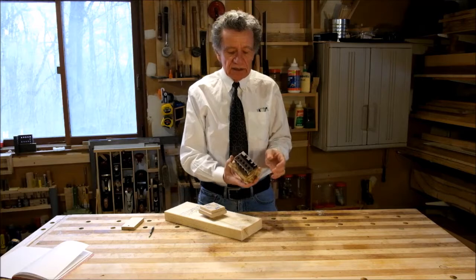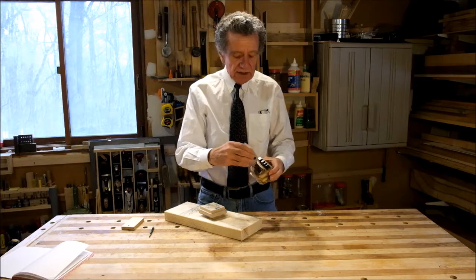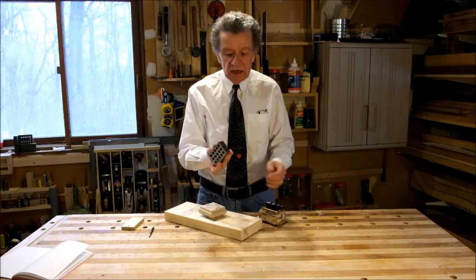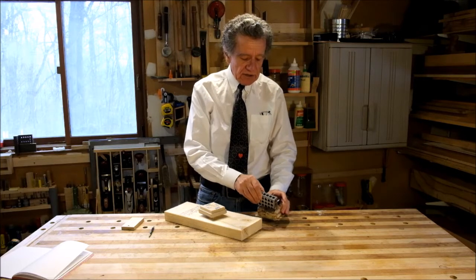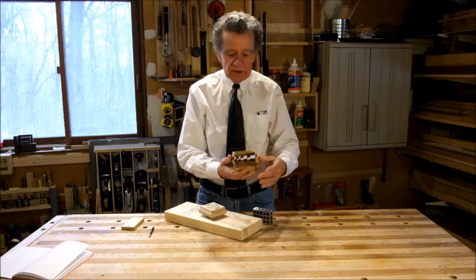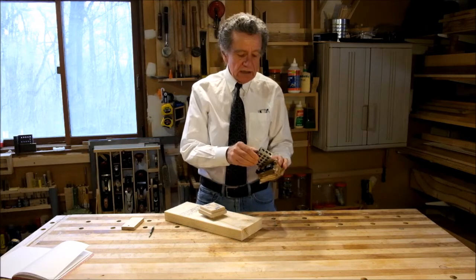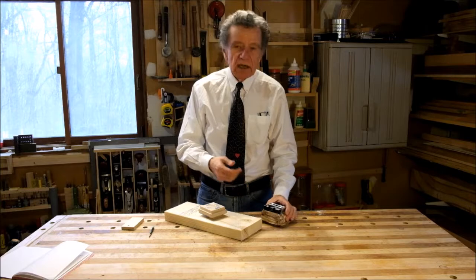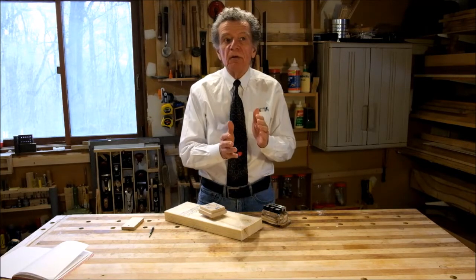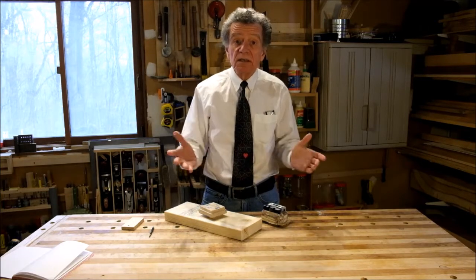The tool I'm glad I bought is a set of setup blocks. These are metallic blocks — a machinist will recognize this as a one-two-three block because of its dimensions: one inch by two inches by three inches. The set also includes fractional sizes: three-quarters, one-half, one-quarter, one-eighth, and one-sixteenth of an inch. You can stack them to mark off any dimension from one-sixteenth of an inch through to a little more than four and a half inches, in one-sixteenth-inch increments.